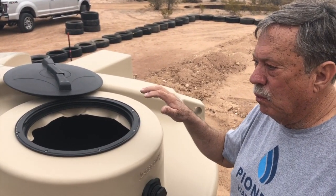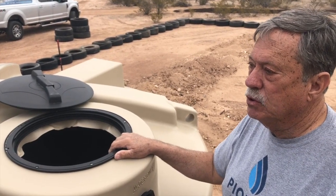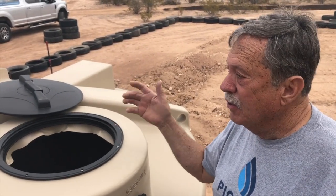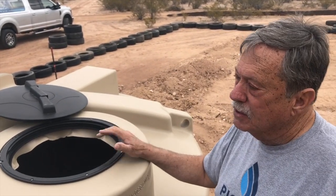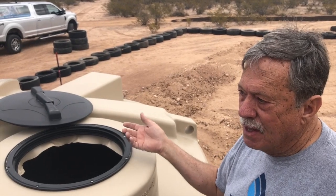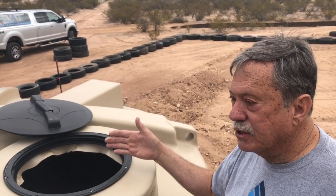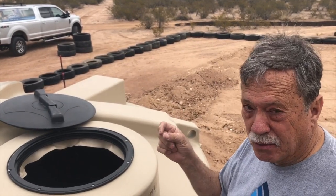When other companies make a colored tank, they use a white translucent resin, and you've seen white polyethylene tanks around, like those box tanks, IBC totes. That's just the pure resin without any colorant in it. So when Bushman or Polymart makes a colored tank, they throw a little powdered dye in with the powdered resin at the time they make the tank. So the tank is colored throughout the thickness of the wall of the tank, but it's not a dense coloration.